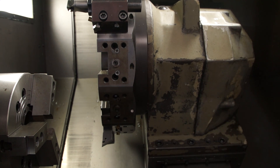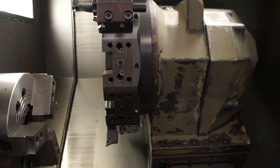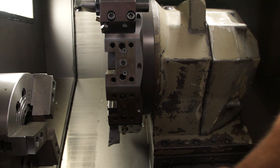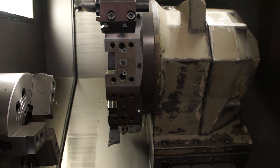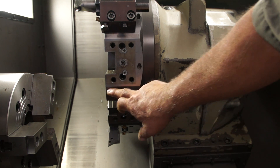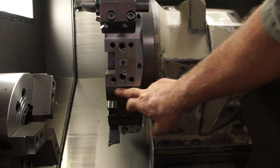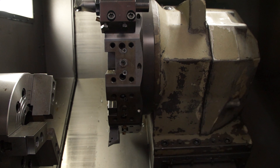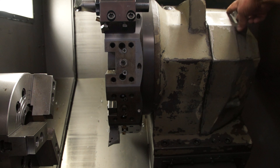If it's tough to bump around, what I've done is taken a little piece of 2x4 and set it between here and here. I'll run the x-axis down and just barely push on it lightly until it's in, and if it's still out and needs to go the other direction, I come and do it on the back of the turret. Then I barely tighten it once this gauge is perfect. I'll tighten each bolt a little more, run it back and forth, make sure it hasn't moved, tighten some more, back and forth, make sure it hasn't moved. At that point, tighten these things down real tight from the 2-inch side there.